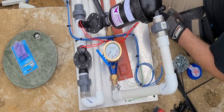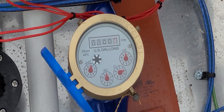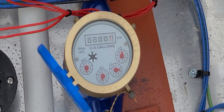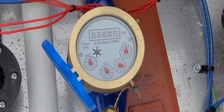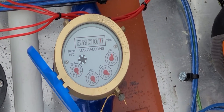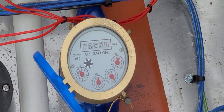At the hydraulic unit we're making the final electrical connections and at the same time we can measure the flow rate. When the dial gets to zero, start your clocks — go. With 600 linear feet of tubing, we're looking at a flow rate of around three gallons per minute. Each revolution of that middle bottom dial represents one gallon, so every 20 seconds that dial should go around. Every number on the clock for that dial represents a tenth of a gallon, giving us very high precision to monitor how the system performs at startup, 5, 10, and 20 years down the line.